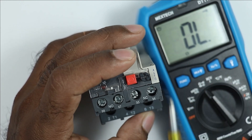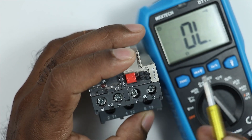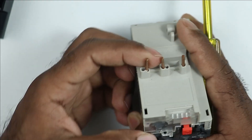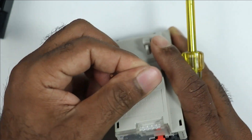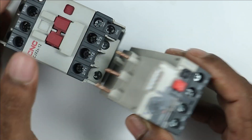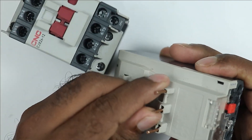In most conditions, we keep this relay in manual reset mode, so that by pressing the button we can reset. Here you can also see that you can move these power terminals in this way. This means for proper connection, sometimes movement of these terminals is required so that it can match with the power terminals of the contactor.